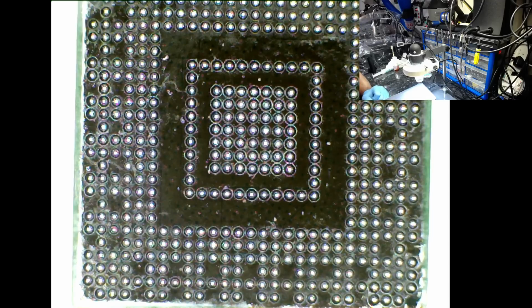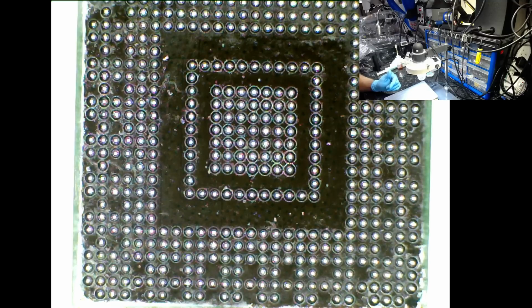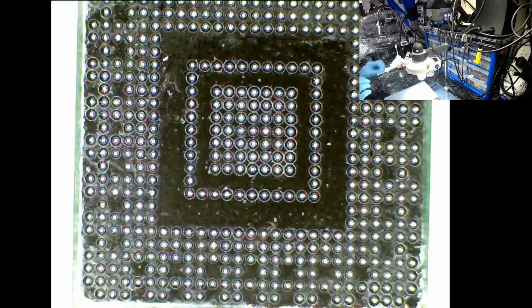completely. Let the element cool down, which is why I give the Metcal HCT thumbs up, because when the device switches off, it carries on running for about 2 minutes approximately, and by then the element should have cooled down. It's just to help prolong the life expectancy of the element itself.